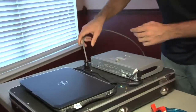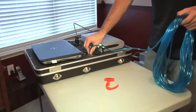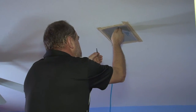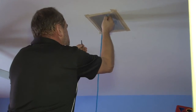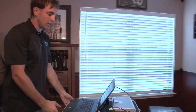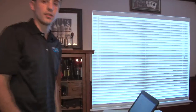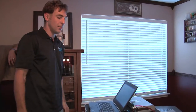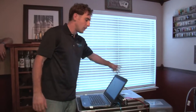We, by computer, determine what the leakage is before we put glue in, so that after we seal the system, we can go back and see how much of an improvement we've made on the ductwork. This is the pre-sealing leakage test. Basically, we're pressurizing the system and finding out how much leakage there is, how many little holes there could be in the connections and in the ductwork and that sort of thing. We have a tube here that goes to the fans, so we know how hard the fan's working, and we have a tube here that goes into the duct system, so we know how much pressure is in the duct system. That's how we measure the amount of leakage.